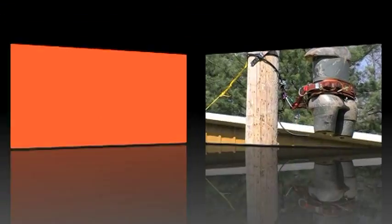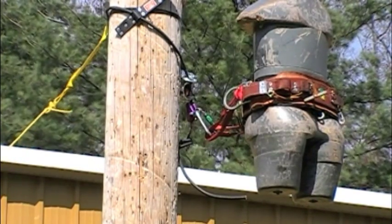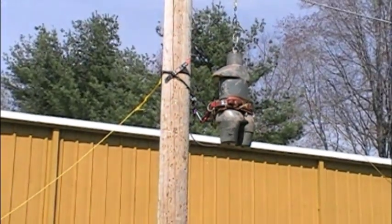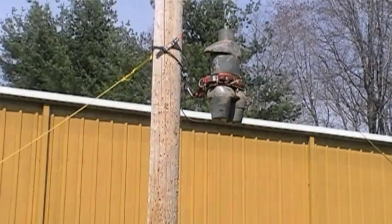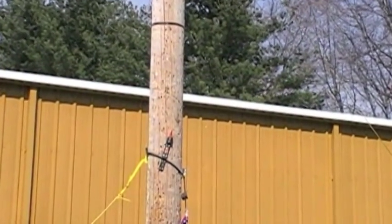Test number four. The pole lariat is positioned 12 inches above the waist. The lariat is adjusted with the parking tab against the adjuster. This is an improper adjustment — it will increase the free fall distance. The pole lariat will be moved down the pole before the weight is released, simulating a lineman coming down the pole. The pole lariat moved approximately 40 inches before it tightened and restricted the fall of the weight.